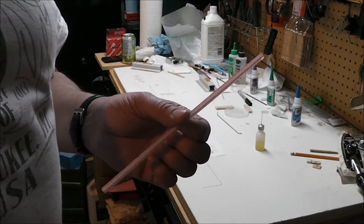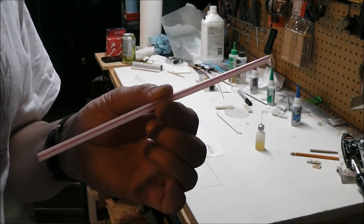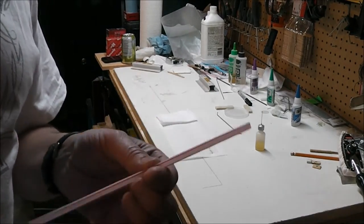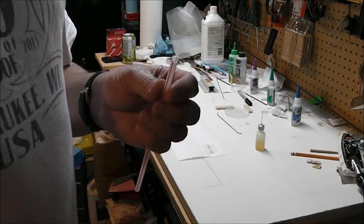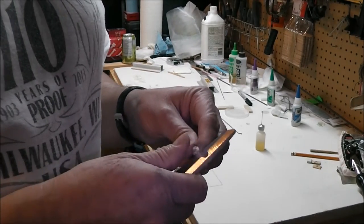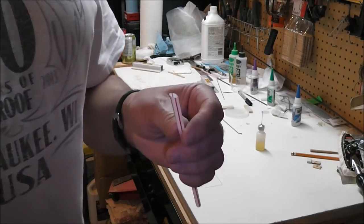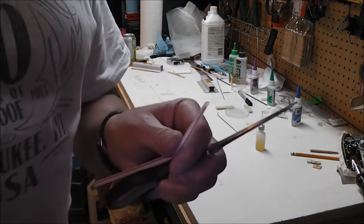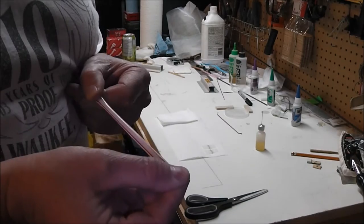The other thing you're going to need is a plastic drinking straw — this is your epoxy injector. Get a bunch of these next time you're at McDonald's, or just buy a package. McDonald's straws work nice because they're bigger. What you want to do with this straw — take the back of scissors or something — and just don't go at it too much because these straws will break. Just make it oval shaped, so you're basically just flattening and creasing the end of it. Then you can stick the straw in your end slot, pull it back, and it squeezes out the epoxy.